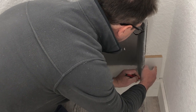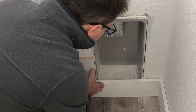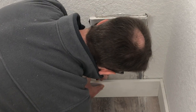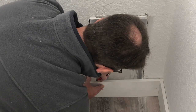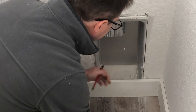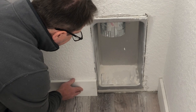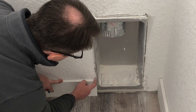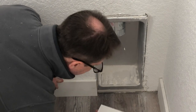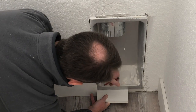Make a mark right there, and then come over here making sure we're still up against the wall, mark that - and that gets us the side-to-side measurement. Then butt this over here so that this piece is touching the outside here, and lay a scrap block under there so this piece is touching up under here, and we'll mark that.